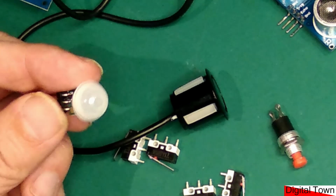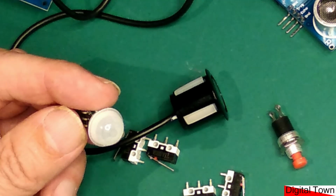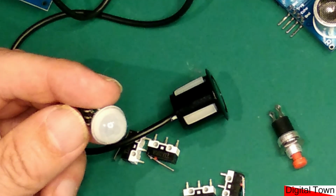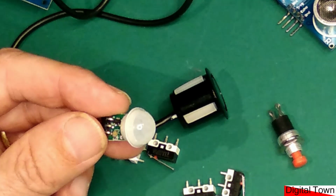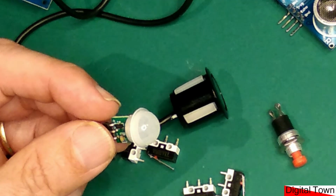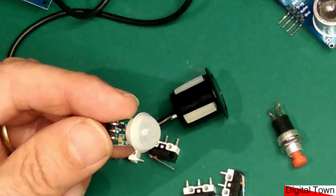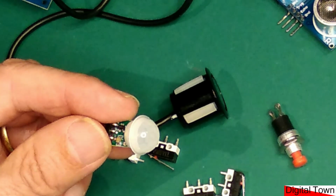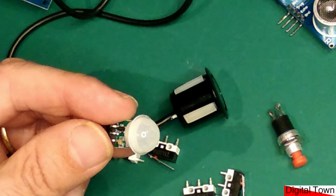The other bit on my cat detector project, let's be honest, it squirted water at cats if they walk by. They don't come in my garden anymore. Didn't want to harm them, but again, one of the issues that I had to think about from an environmental point of view was don't run the pump when it's freezing. Not because I was worried about squirting cold water, but if the water has frozen in the lines or in the pump, trying to run the pump would have destroyed the project.